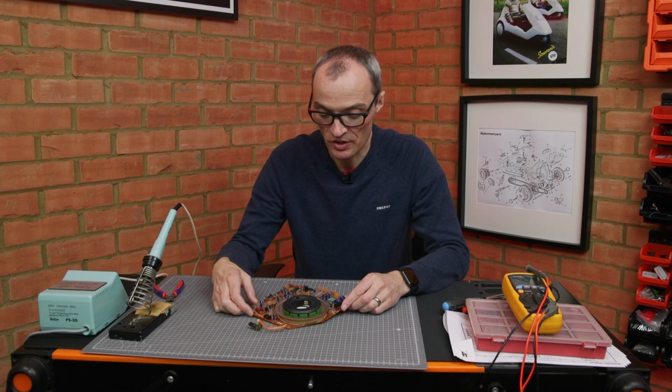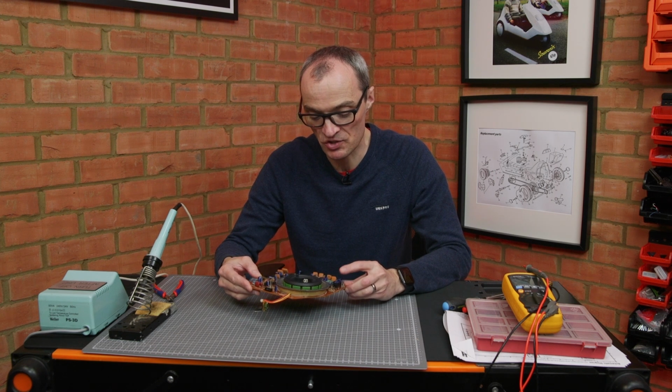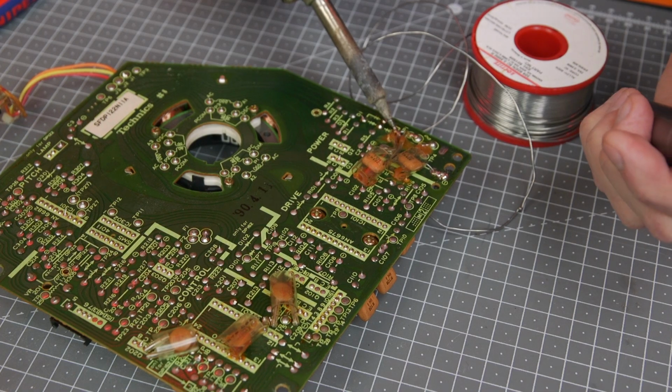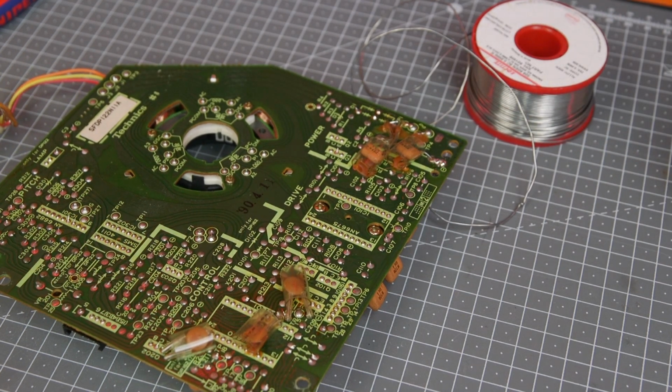And with the board out, time to start pulling out components to check them, and I'm going to start again concentrating in the power supply section with this bridge rectifier. I had to first move the leg of a capacitor out of the way, but I made light work of desoldering the bridge rectifier with my new Engineer solder sucker, which I can certainly recommend.